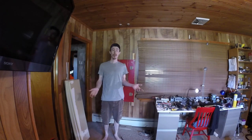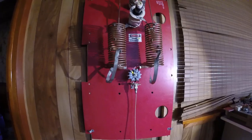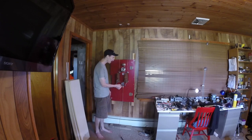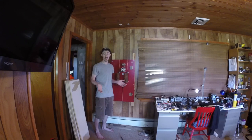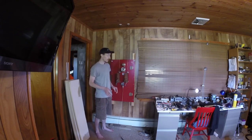Here we are in what I like to call the transmitter room. Behind me is my antenna tuner. It's a double balanced tuner, meaning that it's balanced in, balanced out. So I run a non-resonant antenna, meaning it's really not resonant anywhere that I wish to talk, but that's okay because with this tuner, I can get rid of all the reactance and bring it to 50 ohms J0 with very, very low losses.